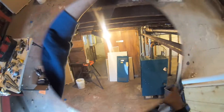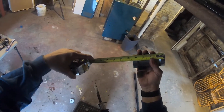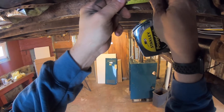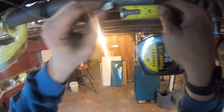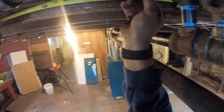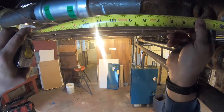You want to be careful when running sanding cloth like this. This is a slip coupling, so it's going to slide right on. You want to measure the entire width of the coupling, put it on, measure into the pipe half the distance, and mark it with a piece of soapstone. Soapstone is a chalk-like substance, but it's a little waxy too, so it doesn't come off like chalk. Now I slide this on all the way, get my end-of-face measure, add for the make-in, and cut my pieces.